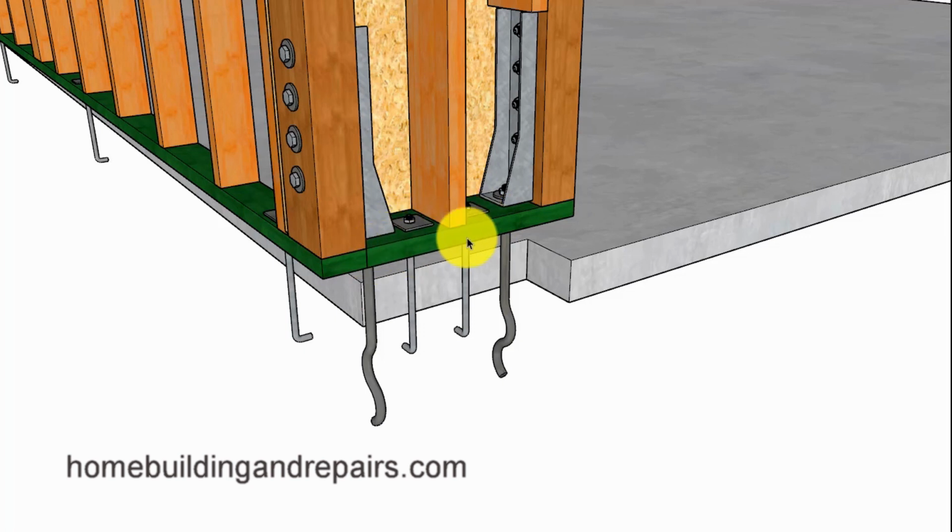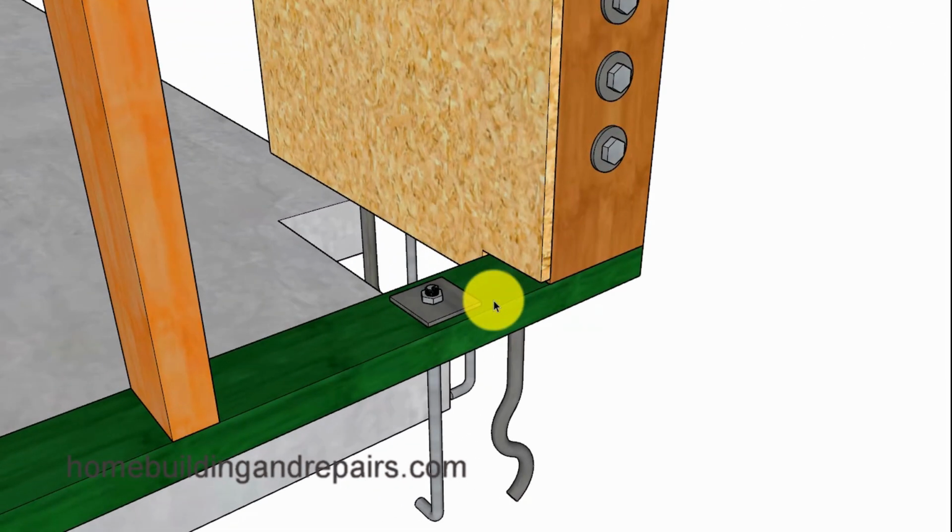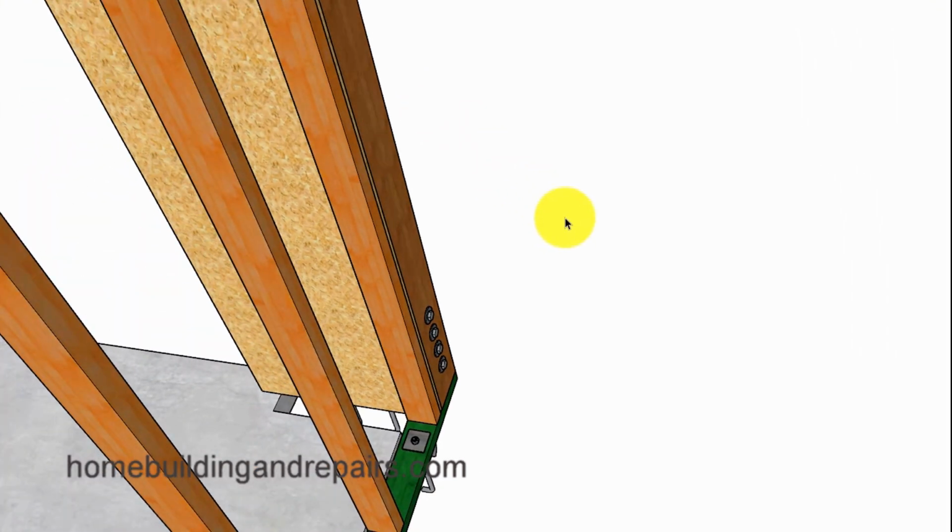And of course, here you can see where I stopped the framing plate here and then ran this plate through and installed the 4x6 on top of this framing plate in this wall here. And if you're wondering which one is going to be better, I don't really think it's going to matter either way. However, if you have to notch around it, then you might not be getting the nailing you need into the bottom plate like we have in the other example.